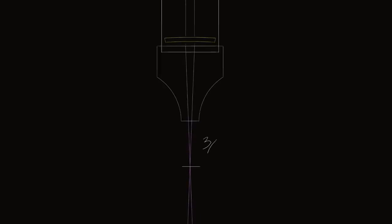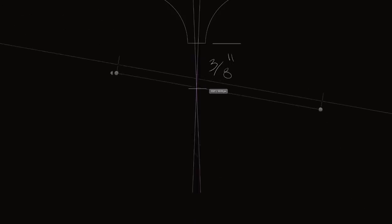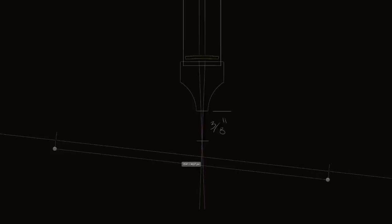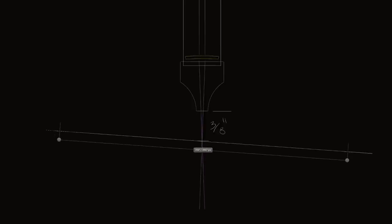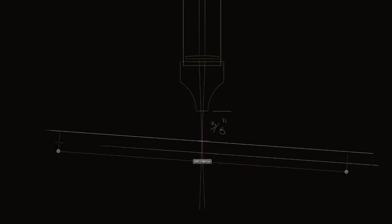In this video, I want to take a look at the cutting characteristics of a 2-inch focal length lens cutting into a .22-inch plexiglass sheet. Using my nozzle, the convergence of my lens is 2 inches and measures approximately 3/8 inch from the nozzle. I will create a series of lines on a slanted surface — this would be the top of the surface of the workpiece, and this would represent approximately the bottom part of the workpiece.